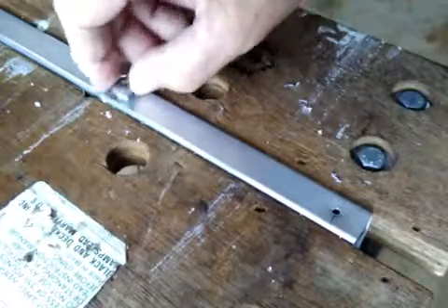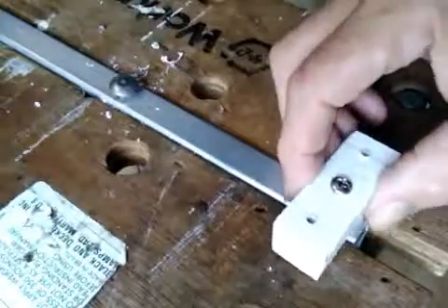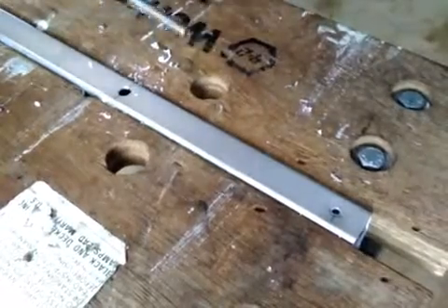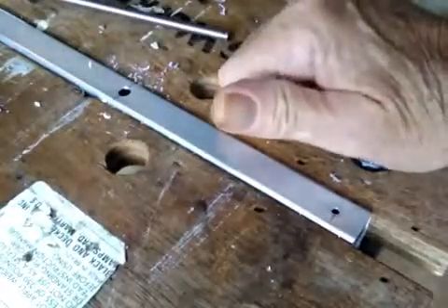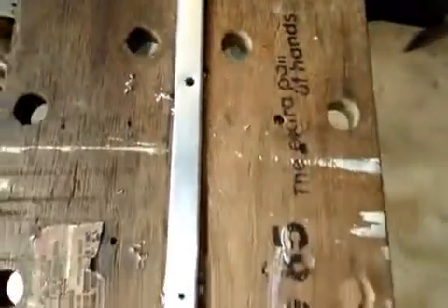This mounts the element backbone to the reflector backbone. There are two backbones in this antenna setup. There are two of those holes — one up here and one here — in between where the insulators mount, just for convenience. So we have a nice piece of three-quarter inch aluminum with some nice holes. The small holes are just drilled through the top; the larger holes are drilled all the way through, and our aluminum is ready.